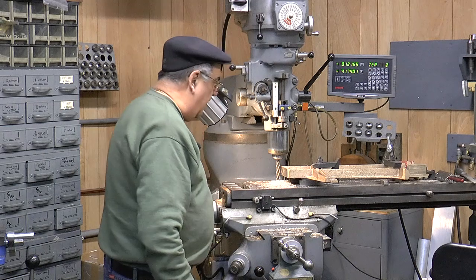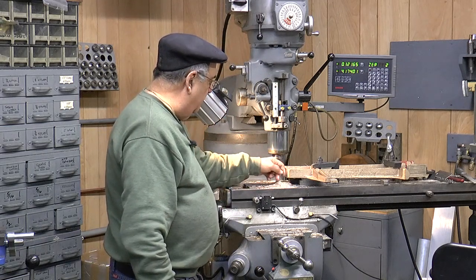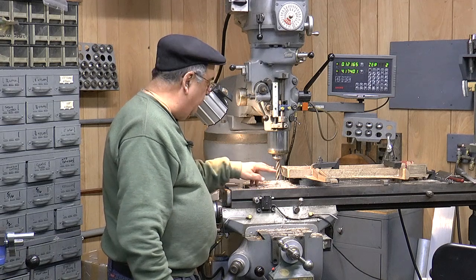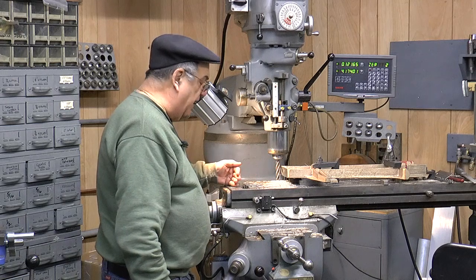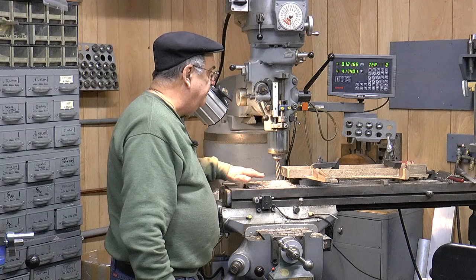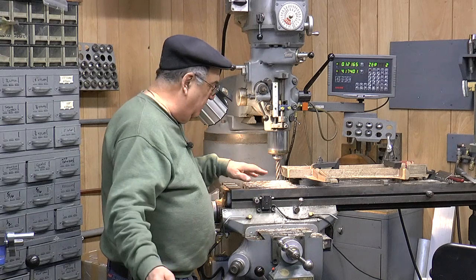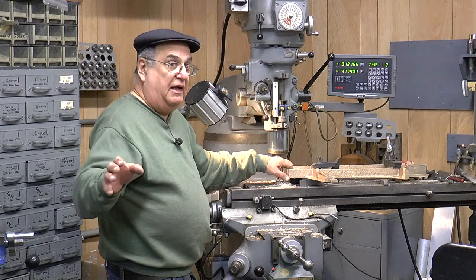Well, okay, that does the end of the long end mill stuff. Milled the back of this because later on we're going to make a bracket to bolt into here. And that's what I use to move a locomotive. I have an angle bracket that I made up that bolts down to a board with wooden tracks. And that's all that holds the engine. You don't need all these bungee cords and gobbledygook and all that stuff. All you need is just a good angle plate that bolts heavily into the cradle, and that's the end of that story.